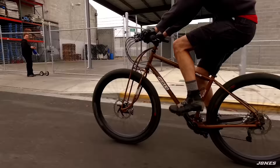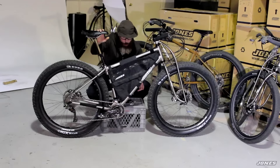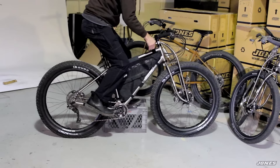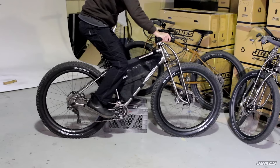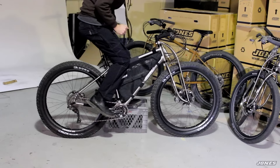The geometry numbers on this are far from normal, but the bike has a really nice ride and it opened my eyes up a lot to how I had been riding. A little bit about the body position geometry: I have it set up so that I'm standing more on my feet. The fit is very different than a normal mountain bike or road bike. Most bikes have a longer reach up front because the top tube length is actually longer, which moves the head tube forward. The steeper seat angle moves your butt forward, so you're generally leaning forward in a falling-forward position. With this bike, the seat is slid back — I've been doing this on my bikes for years by changing the seat angle. This has a 71-degree seat angle, shortening the forward reach. This bike has a reach of around 400 millimeters, which is shorter than a size small of other brands.